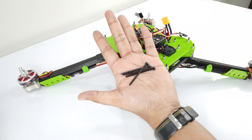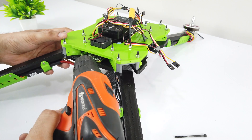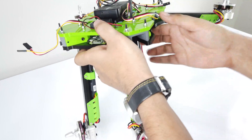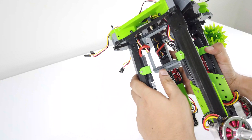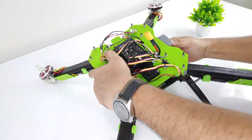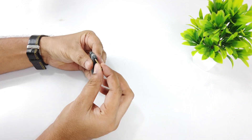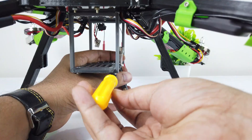I'll be using 50mm M3 screws to attach the arms. After connecting all four arms, the drone has taken its shape. Now let's verify its folding design — it looks quite compact after folding the arms. Now let's move on to the next part. This is the folding mount of the landing gear, intact with all the nuts. Slide the landing gear in from the side and attach it with Phillips screws. These tiny hinges prevent the landing gear from further movement and also support the battery mount. I have assembled them using M2.5 screws.